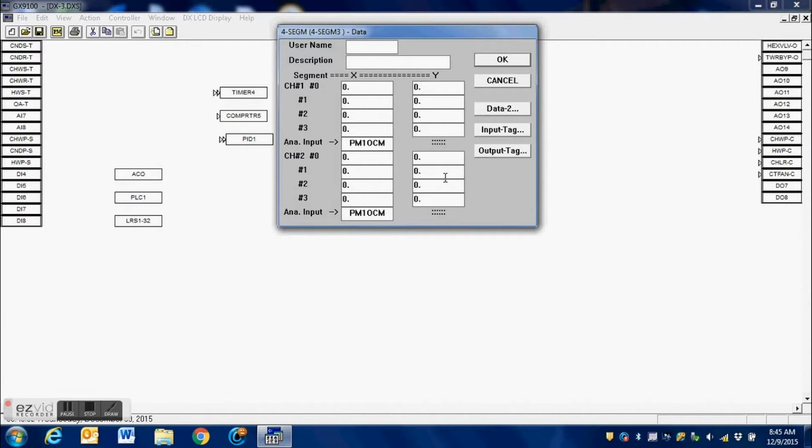Channel 1 is going to control from zero to 33 percent of the output of that PID loop. What we want it to do is drive that valve to 100 percent when the PID loop reaches 33 percent of its output. So we enter 33 here, and on the right side we enter 100 percent — which means that output on a zero to 10 volt signal will go to a full 10 volts. We enter our values here.